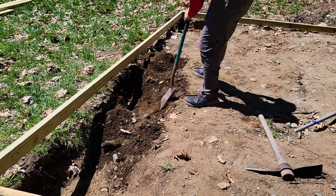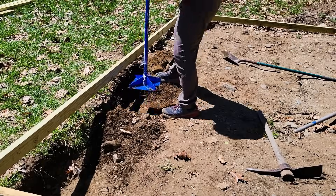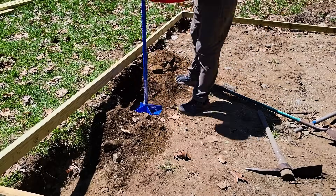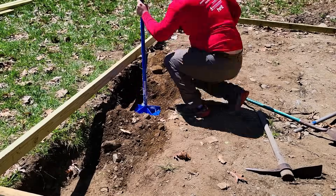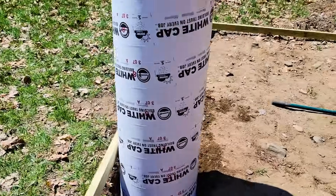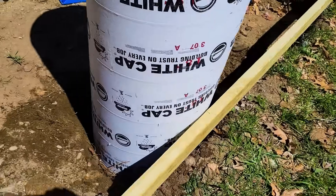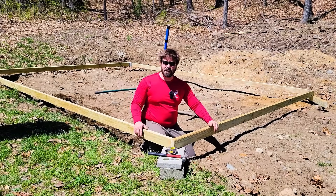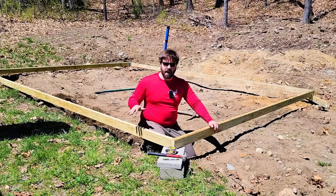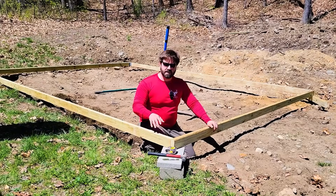Different soil types can carry a different amount of weight per square foot. Mine is sandy gravel, but it's really important to know your soil type in your area because that will determine how much bearing capacity you have. I'm going to get into this more in the math portion of this video. Let's see if our form will fit - we can see that form is nice and vertical, so that means I've dug out enough. That's the general process: we need to make sure that we're below the organic material because that will decay and shrink over time.